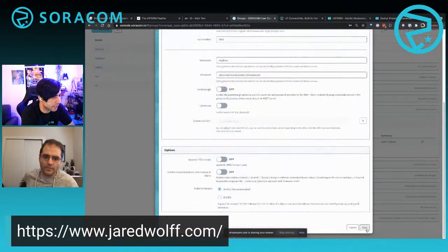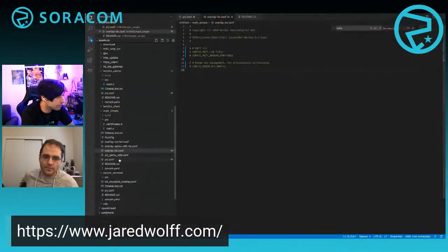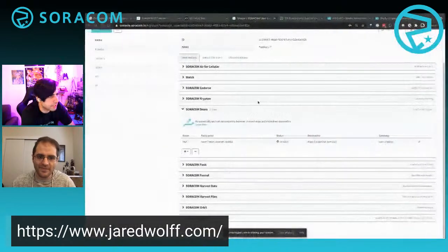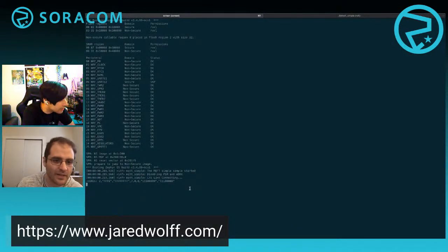I didn't have to do much more modification to the sample other than configuring it to connect to beam.soracom.io as the broker, because originally it was Mosquitto. And then the topics for Adafruit.io, where you give it your feed. I had a couple of topics there. So let's see if it's connected. I might still have trouble connecting because I live in a Faraday cage.